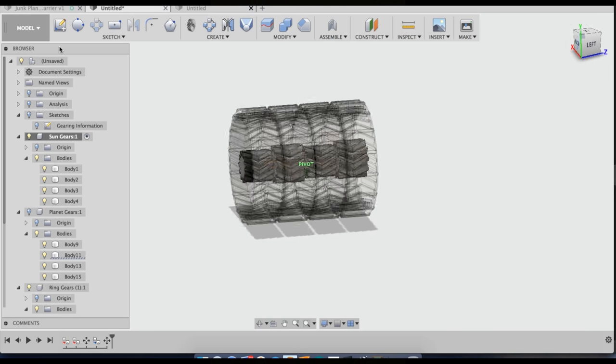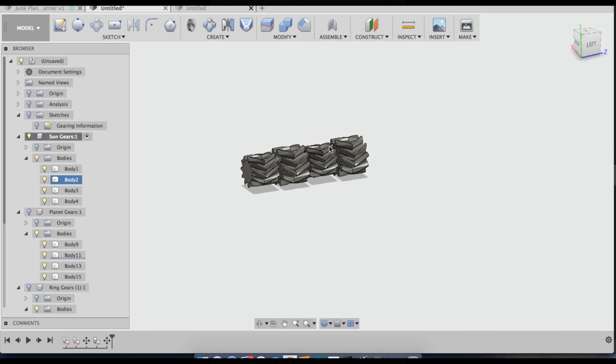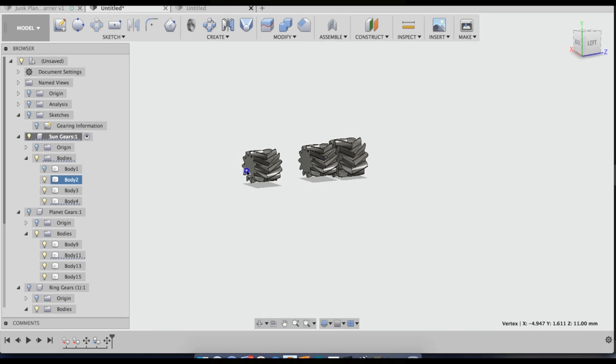So anyways, normally I go in and I combine. Normally I don't use this sun gear, I just take it right out. Then I combine this sun gear directly with this one and put the motor shaft through here. That allows you to tie modules 1 and 3 together even further, giving you even less chance of the gearbox having backlash and various other things. So that's something I'll get to.